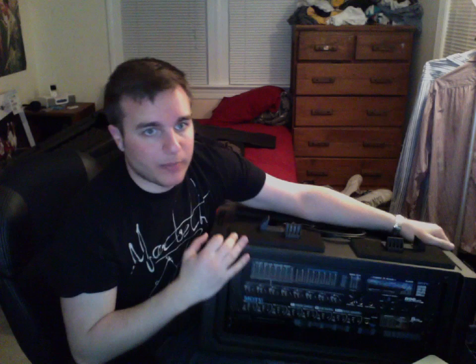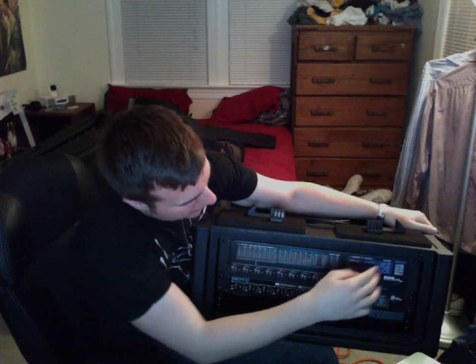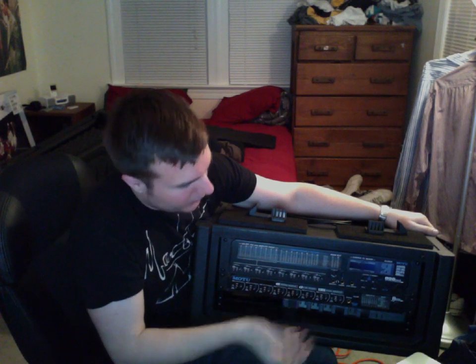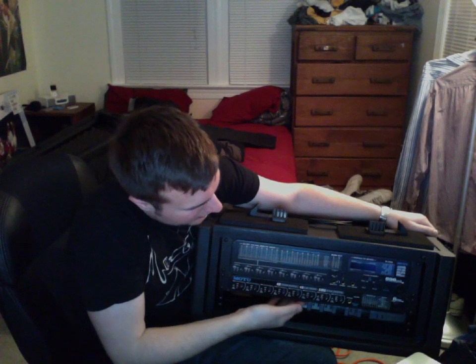me out. So basically, the big thing that I think everyone's doing wrong, and what I was doing wrong, was I was trying to make the 896 the clock source, and the 8 pre I would sync to that, and apparently that's completely backwards. The 8 pre is the one that needs to be the clock source.